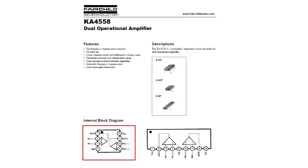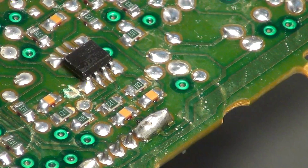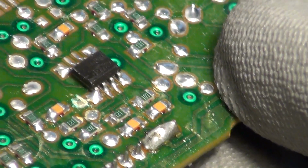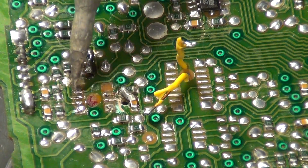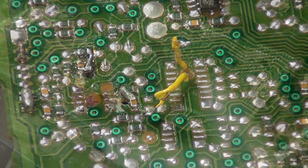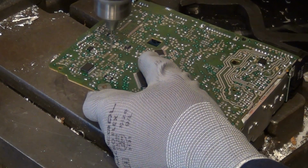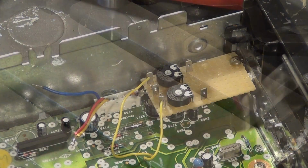Like in my earlier car stereo hack video, I first shorted out the inputs and totally disconnected the outputs from the circuit by cutting off the paths. But then I decided to remove the integrated circuit entirely by desoldering it. With the chip gone and the output paths cut off, I soldered two wires to the path leading to the audio controller and led them through two holes that I had drilled through a vacant spot on the PCB.